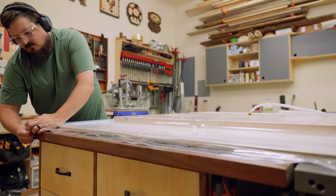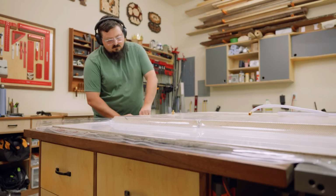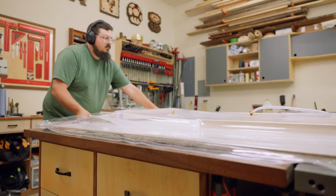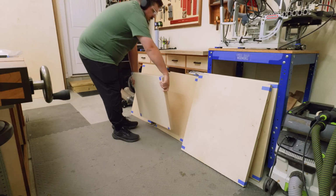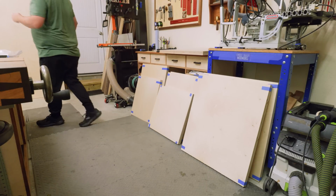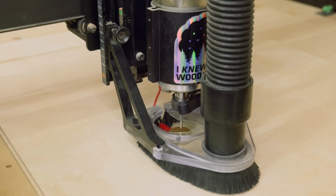This will give me laminations that are just as high quality as the original layers in the Baltic birch. And I think that's kind of important to point out, because people see Baltic birch and they immediately just see dollar signs. But high quality plywoods like Baltic birch or marine grade ply are more expensive because they're void of voids and they're incredibly dense, which makes them great for adding structure to projects where it's needed, like chairs.